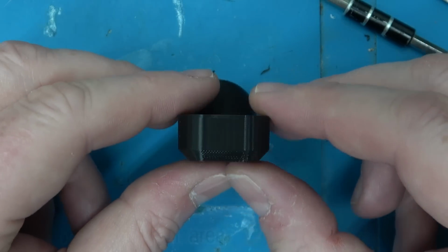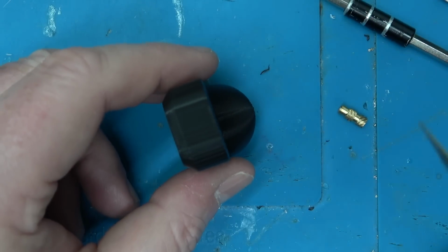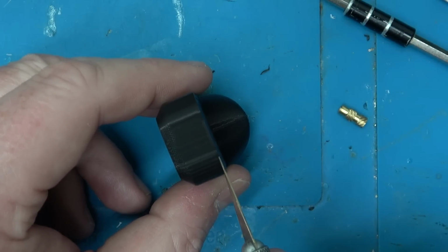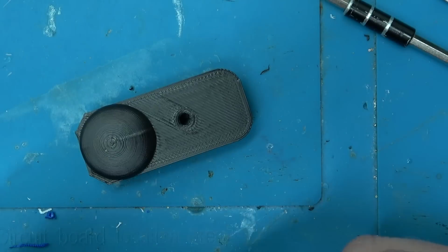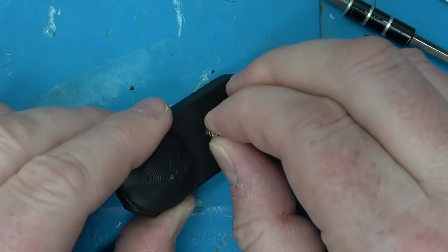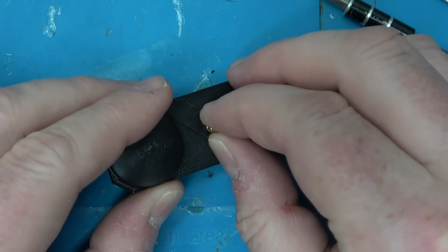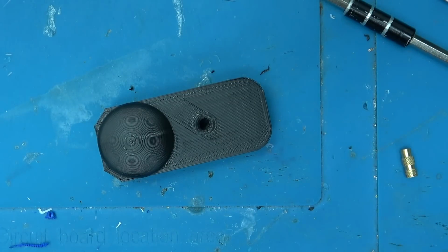Yeah, it's very smooth walls. I know I always say this, but you can see the difference between the main walls and the cap walls at the top. The tolerance of this hole is a little off. It's supposed to be 3.9. This heat set doesn't quite fit. Guess I could give it a little love tap with my...